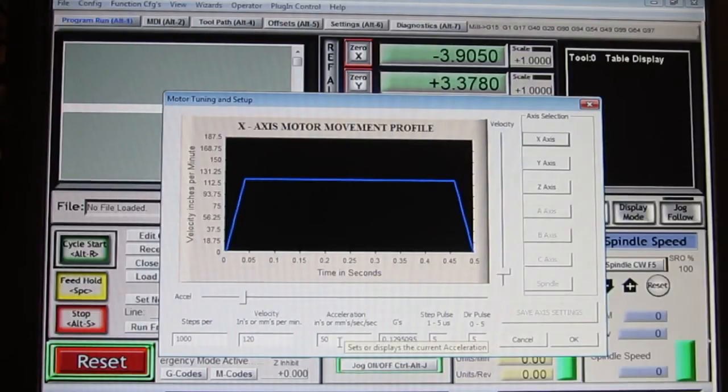And here's the deal, again, perspective. Because I chose a blazingly fast table speed, 2 inches per second is pretty fast, I had to compromise on the acceleration. I have to give the stepper motors plenty of time, when they get turned on, to accelerate up to speed. And so I got the acceleration down to 50. Well, let's use round numbers. We'll make it 60 inches, and that's going to be, again, 1 inch per second. So it's going to accelerate over 1 inch in 1 second.